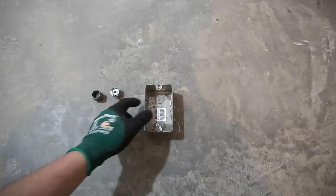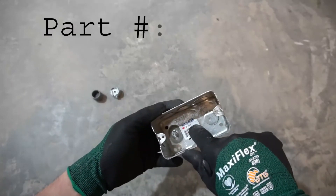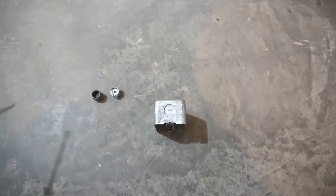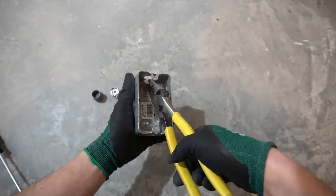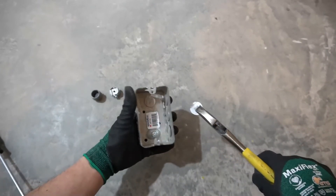Let's prepare a box. This box is called the 1110 — the part number is BC-1110. Let's knock out the top tab of this box, which is very easy. Get a flat head and linesman, just knock it out, then twist it out. The tab breaks off.